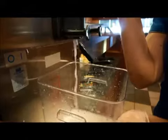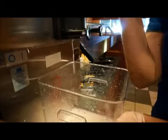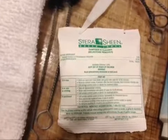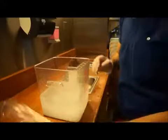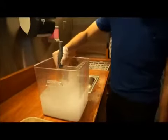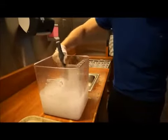After the machine has been thoroughly flushed with cool water, prepare the correct volume of approved sanitizing solution. The sanitizing product typically comes in a packet and contains both the cleansing and sanitizing agent. Thoroughly dissolve the cleaning sanitizing powder in a clean bucket using warm water and stir until the powder is completely dissolved. Since the cleaning sanitizing product used for most machines has both the cleansing and sanitizing agent together, this should only be a one-step process.